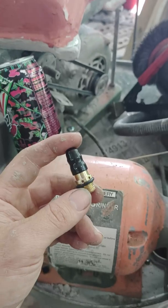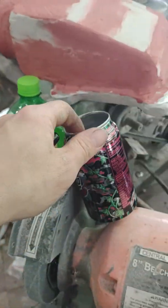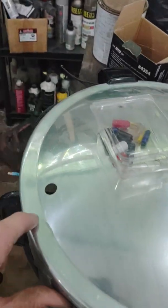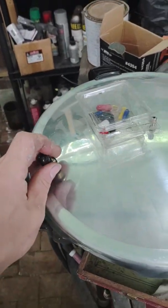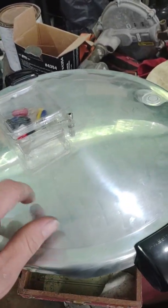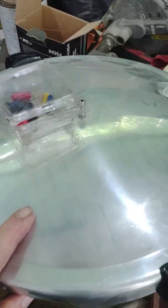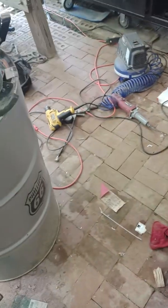I had a fitting, drilled some holes in it. I'm going to drill a hole in the bottom of this - it's going to go in here like that. It's not going to thread; I have a little slip fitting. I'm going to use a pressure cooker in order to generate steam and try to set these beads a little better. Just a note of safety: don't use a threaded fitting, nothing that can actually bite into this, because this is a boiler. You do not mess with a boiler - otherwise it is a bomb and it will blow a hole in your house. Look it up, you'll see some pretty impressive results. Do not fool around with these. We're going to try it this way.